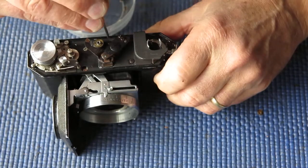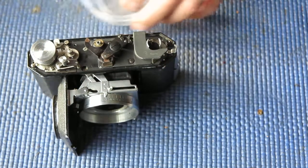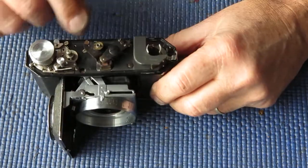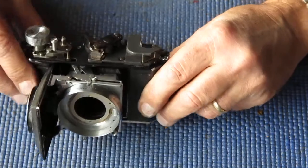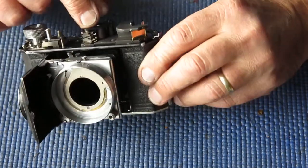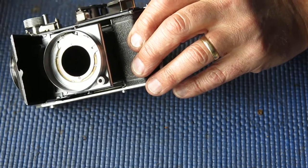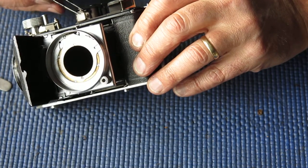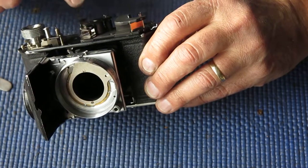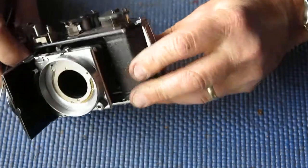There's an awful lot of pencil marks around the inside of this camera, whether they're from servicing or from manufacture, I can't really tell. Okay, so optical components in the rangefinder here. Well, we have a prism here, a simple glass prism. Two faces are easy to get at the front. Clean those, they can be cleaned with normal glass cleaner, not a problem.